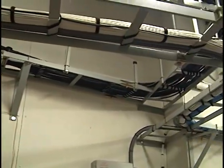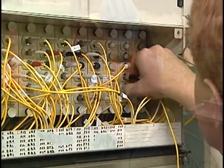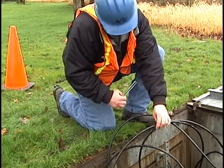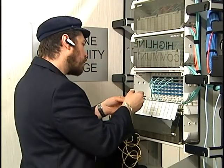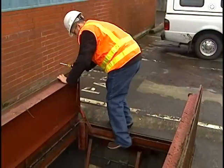Using the CFT810, you can turn a specific fiber into a sensitive audio microphone, which can then be localized and identified by gently tapping or scratching on the cables. The sound is monitored through a headset or earphone connected to the instrument. Proper operation generally requires two technicians — one at the launch end of the fiber span to be tested, and the other at the point where the cables must be identified.